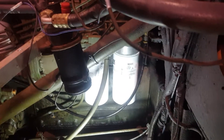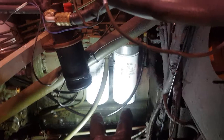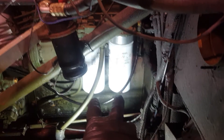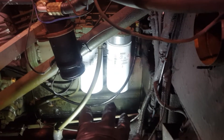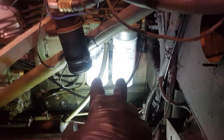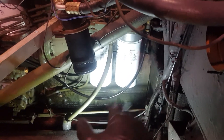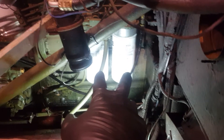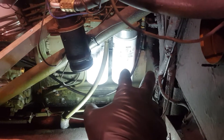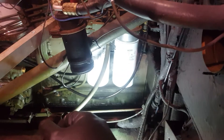With an LD or LDT motor you've got a max of 40 to 50 PSI pressure running through those under a load. With an LDS motor you've got 40 to 45 pounds at idle and up to about 80 pounds of fuel pressure in those filters under a load, so you really need to make sure those filters are on there good and tight. Of course don't over-tighten — you don't want to break the fitting off or strip threads. On my truck because I've got an LDS, I take a nylon strap wrench after I've got them hand tight and give it another quarter turn, and even then I've still had some gasket leaks.